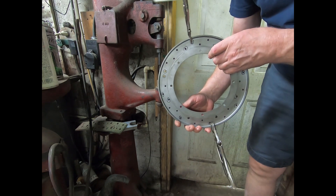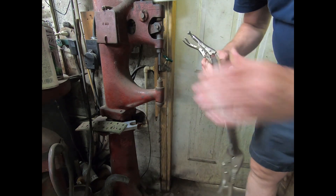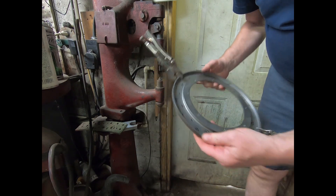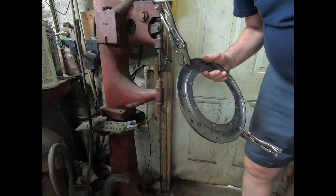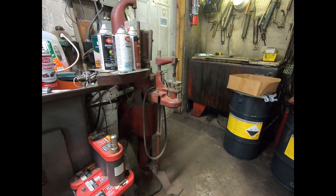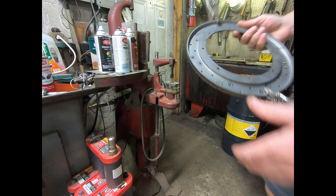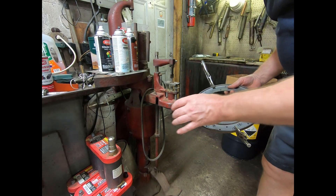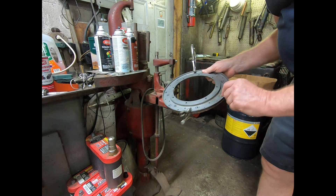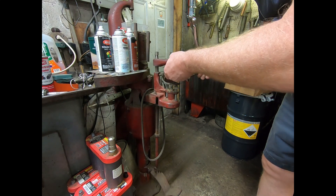And that's how it works. This plate bolts onto the flywheel. The plate that bolts onto the clutch pressure plate is much thicker and a little bit different to do, so we'll do more drilling here. Normally I like to do one or two rivets at a time — you don't want to get too far ahead of yourself. So we put these rivets in over here, and now we want to work over onto the other side and do those two.